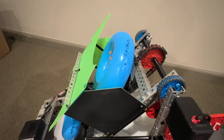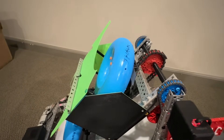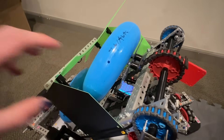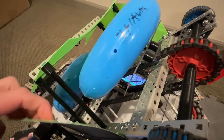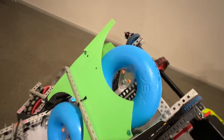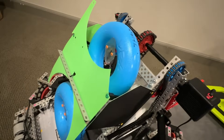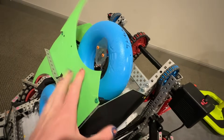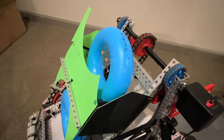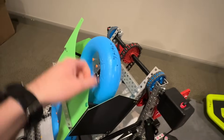And now we have the green box, which looks quite silly — it's got a little color sensor in there, you can kind of see it poking out right there. It's a silly green box, but we never color-sorted the wrong color at worlds — 100% consistency. It always de-scored the wrong color and never accidentally scored the incorrect color or threw out the correct color. The green just acts as a backdrop because it's in the middle of red and blue, giving it a nice consistent color, and because it's all surrounding, it doesn't really matter what outside light is shining in. One side snapped at a meet but it still worked; the other has hung on all season. This robot was built in November and has probably been in close to 100 matches including scrimmages.